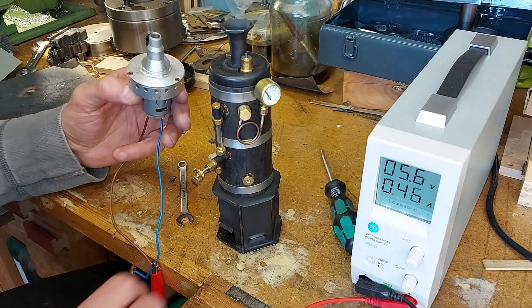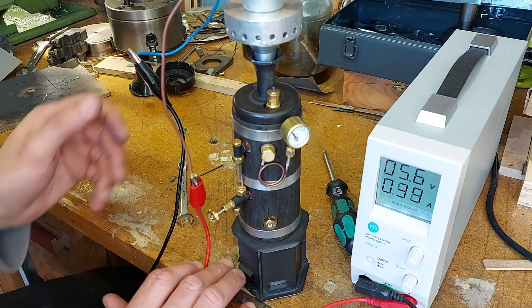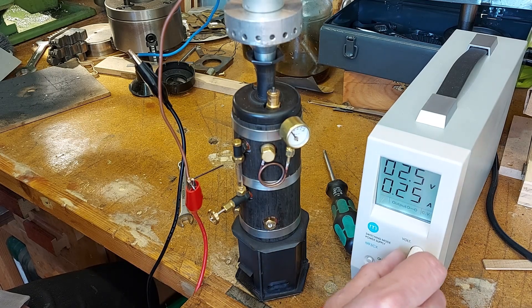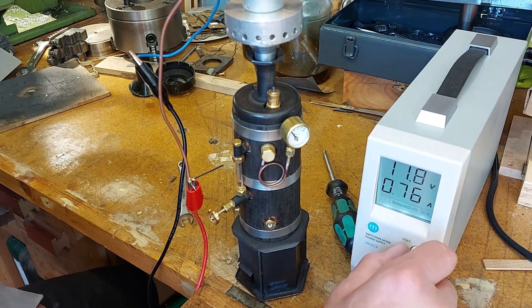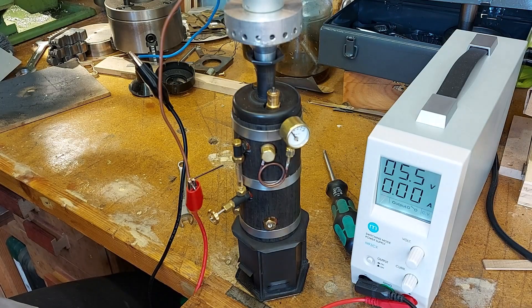Here's the boiler. When we put this on the very top chimney of the boiler, we get an airflow through - air being pulled through there, nice and simple. We can change the speed of the fan. It's operating down at 2.5 volts and will operate up at 12 volts, though I'm not sure I want to run it at 12 volts for very long - I think that's okay for just a short time. So that's the steam raising blower fan.